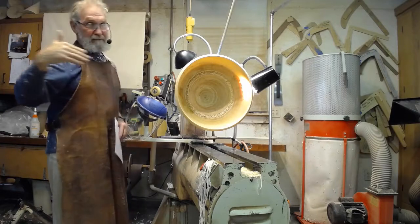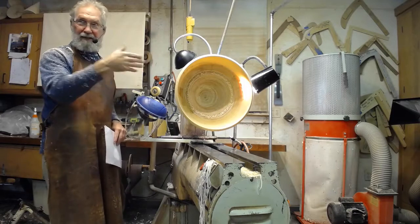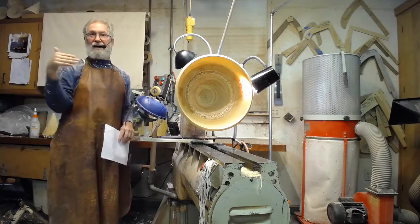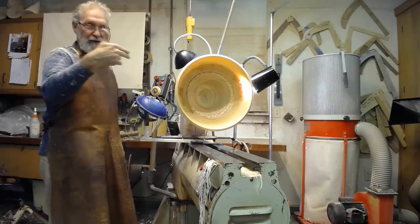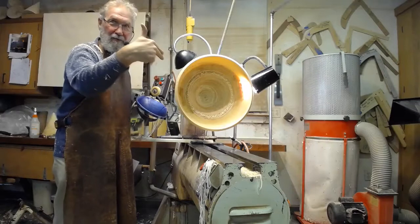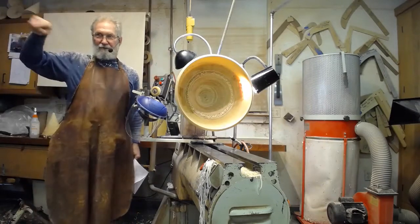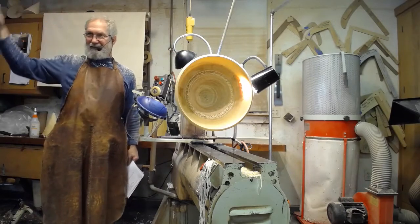Also, the McNaughton system is based on side grain wood so that you can snap out the piece, and the cutter is working in the direction that you would normally work on the inside of a bowl. So I don't think it would work nearly as well going into wet wood in this direction. It would also lead all my shades to start to look like the same shape, shallow hemispheres.